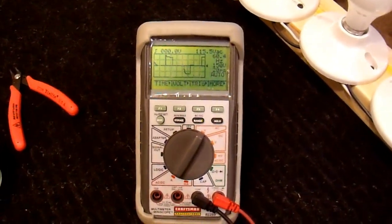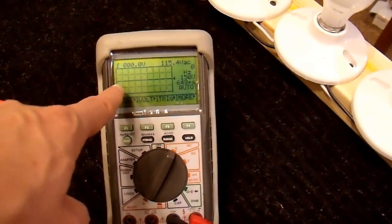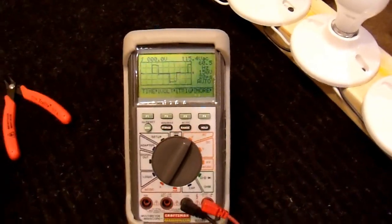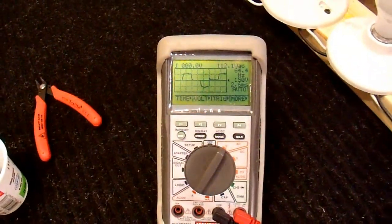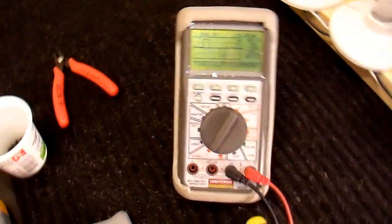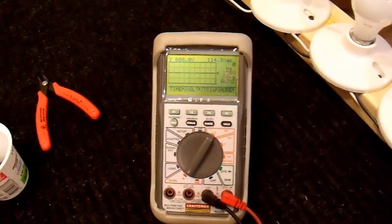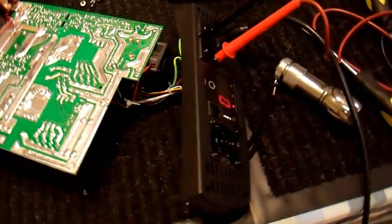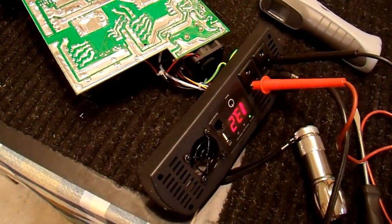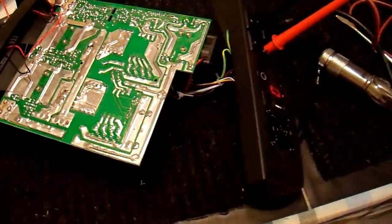Take a look at the output voltage waveform — it's completely different. This one is much less well regulated than the other inverter. You can see that it has very high and narrow spikes once this multimeter starts triggering properly — a completely different waveform. Also, if I turn on one of my light bulbs, the fan goes up to full speed immediately. It doesn't have the same variable speed fan that the other one did. The voltage still looks like junk. If I turn on a heavier load, which essentially lowers my input voltage, you can see that the waveform looks different — the other inverter did not behave that way. So this one is completely different in its functionality, and will undoubtedly perform quite differently. When you buy these CPI 2575 inverters, you really don't know what you're going to get — here are two that look about the same, from about the same time period, yet they're not the same inverter at all.